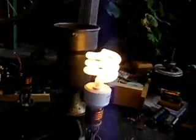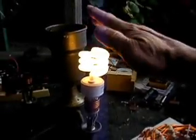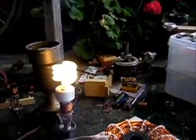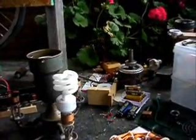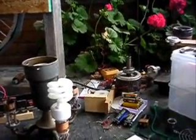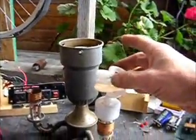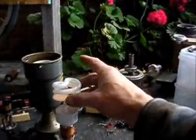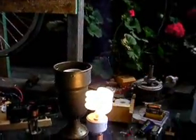Boom. You can see that light comes on. That's sitting at 720 hertz. You can mess with the capacitance here and change around. I'm going to switch frequency up. 763, 808, 856, 907. You see, it don't want to do that. Go back down. 856, 808. See, it pops right back on.